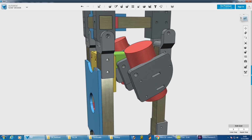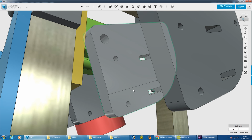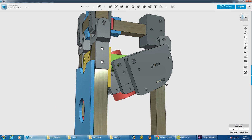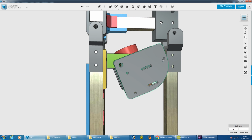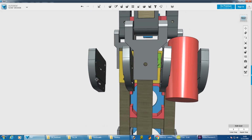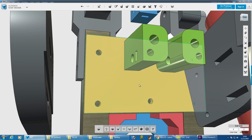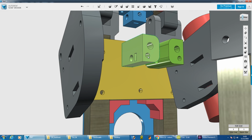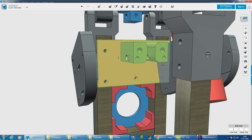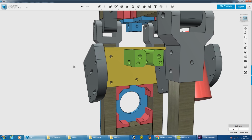And then attached to that is a clamp that holds the motor, and you'll notice I've drawn these so we have the step in the middle because one side is thinner, and those are bolted together with some studding through the 3 holes there, and as again 6mm stainless fits through there and is attached with a captive nut which is held inside. So if we just get rid of that, we can see there's a captive nut and another screw hole there to put a 4mm bolt in to hold that axis. So we're going to need some stoppers on the outsides of these to stop the thing slipping off, but we can deal with that afterwards.